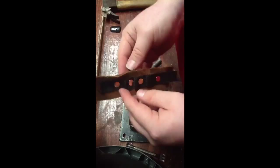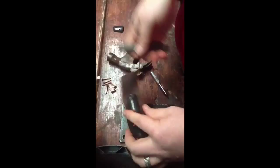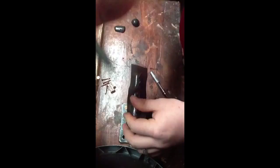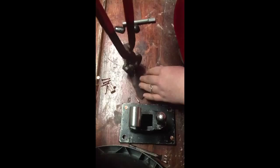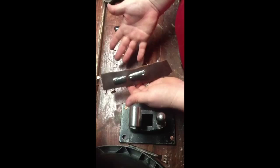If you look at these two pieces you'll see there are two different heights. That's because we've shaped the nail to the inside shape of our piece of metal. We want to do that to every single nail as we work. Now get our clippers and clip off our nails. You're going to be clipping with the clippers flush to the metal, which will leave a little nubbin sticking up.